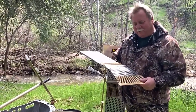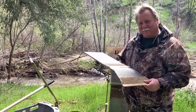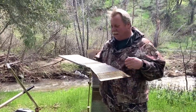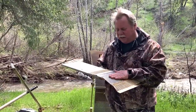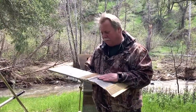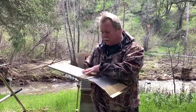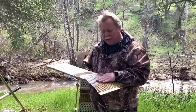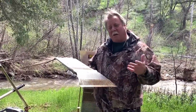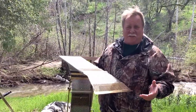It's kind of based on the same theory. The woven wire creates a lot of drag on the water, slows everything down, drops the heavies through, and it really drops the water speed underneath it. But I also tend to think that if you leave too much of an area open with the woven mesh, it might create too much divergence of the water flow, or it might create a back pressure. That's why we're testing it and salting it with gold — to see where the gold actually ends up in the sluice.